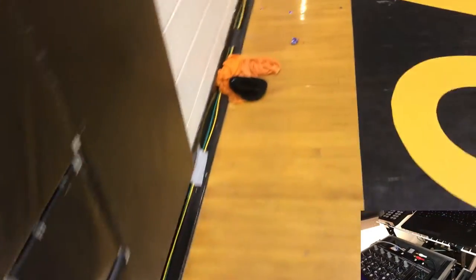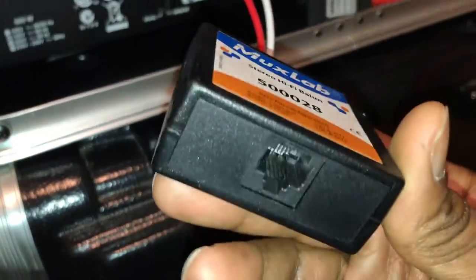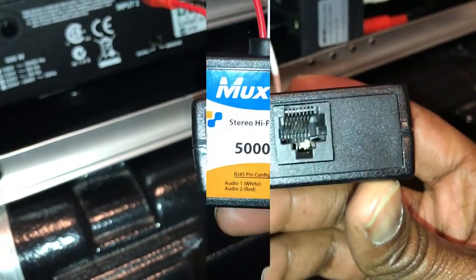This is a good alternative. I've seen a video on YouTube where someone used coaxial cable with an RCA adapter to plug into their amp or speakers — coaxial is really great for long cable runs. But the problem with that is you're going to need two thick coaxial cables. With this cat5 setup, you're talking two channels of audio with one cable.